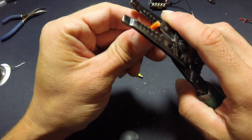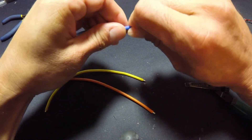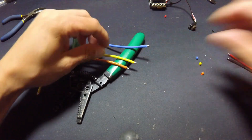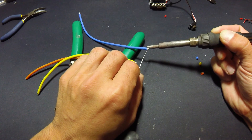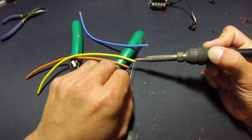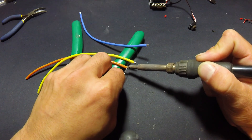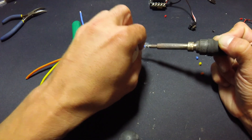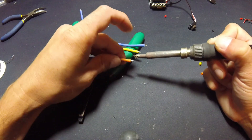If you look on the bench below, there's a lot of loose wires and stuff — you want to keep tabs on that. I've seen plenty of people's workspaces cause them problems long term because there are loose wire strands laying around. Mystery shutdowns, random failures — those little strands of wire get down in your RC and cause problems, or worse, as you solder them in they'll flick free and touch the tabs next to them. All sorts of fun stuff can happen, so keep an eye on that sort of wire catastrophe.